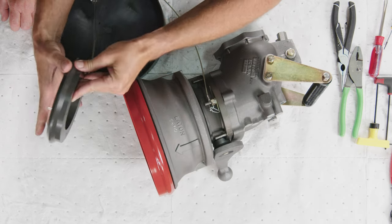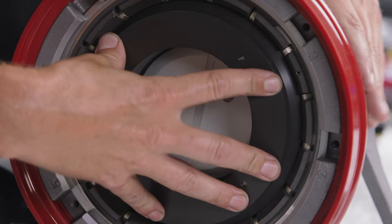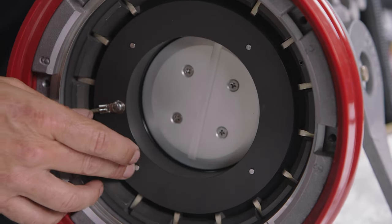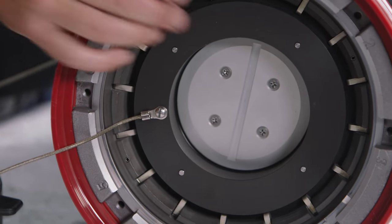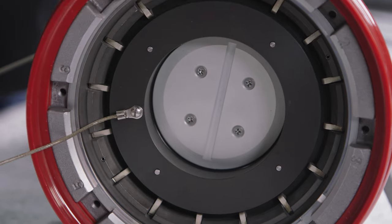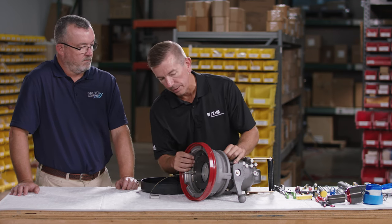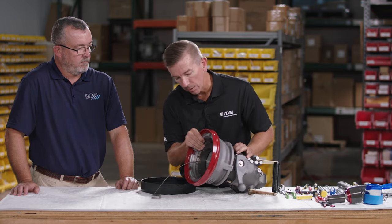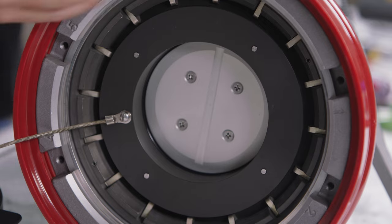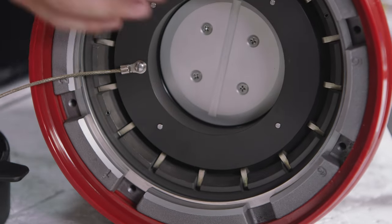To use the wear tool, set it with pins towards the coupler, push the detent pin, and pop the lower half out. With the half extended, all four pins should be raised above the surface of the wear gauge — this indicates a good coupler. If any pin is below the surface, it indicates worn lugs or a worn collar or body. Rotate the collar 360 degrees while the gauge is installed to check all positions and make sure no pins lower in certain spots.